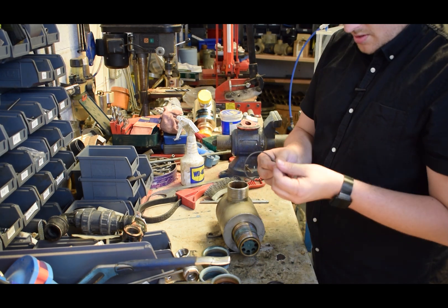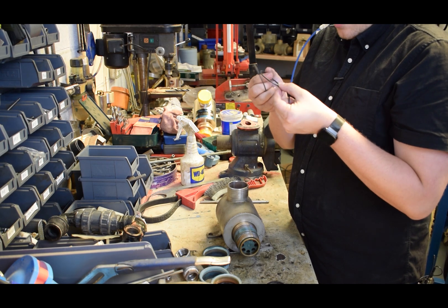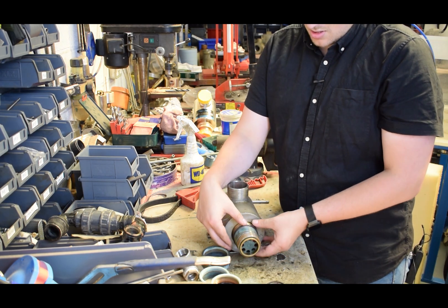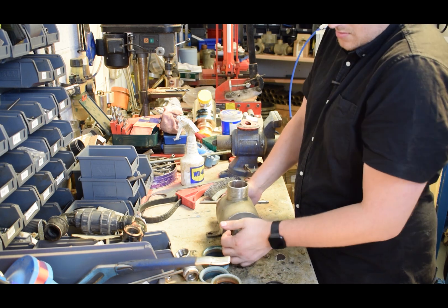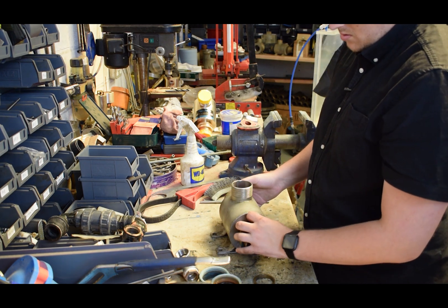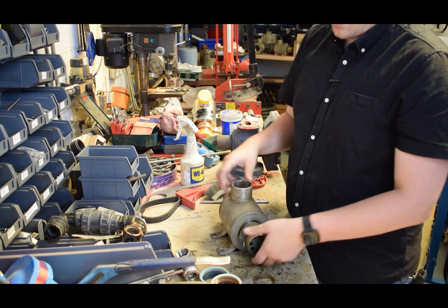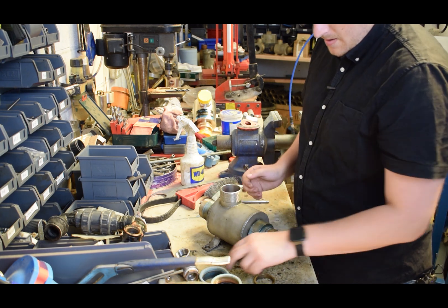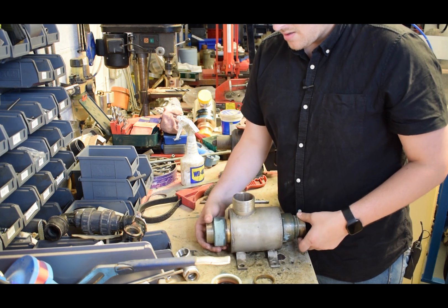Next are our o-rings. Here are some newer o-rings - you can see the old ones are a bit worn and flat on the inside. The new ones just slide over and roll on. The spacer will keep falling out until you've got an end on, so you can leave it out for a minute. We'll put our collars on - just put the o-ring on a bit more, then these collars spin back on. This has probably been around for 20 years and they still slide on nice and freely, which is why we use the brass fittings.